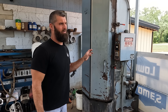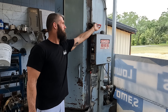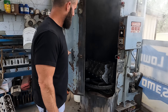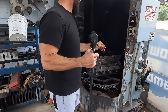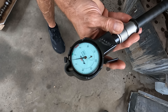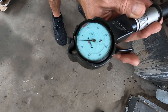It's running right now, so I'm going to stop it and let it settle a minute and then we're going to measure and see what this thing looks like. So it grew exactly — we were at five tenths — it grew two thousandths.